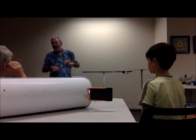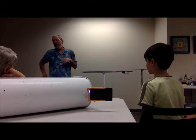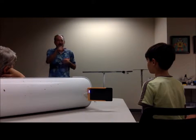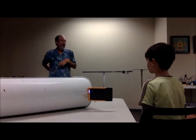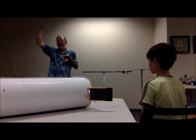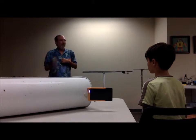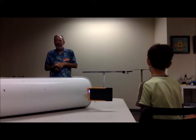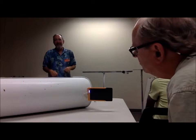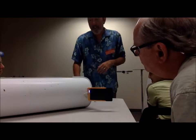So got it down to 5, and it wakes up twice a day, right? When you get mail, and when you get the mail back, and it sucks 300 for like a minute while it's communicating on Wi-Fi or whatever. But it's such a small amount that the battery was always able to be recharged. And from then, the battery charged all the way up to full power, and it basically doesn't drop below full now, it pretty much always seems 100% charged, but it took a huge amount of work to get that power consumption down, which is surprising and annoying.